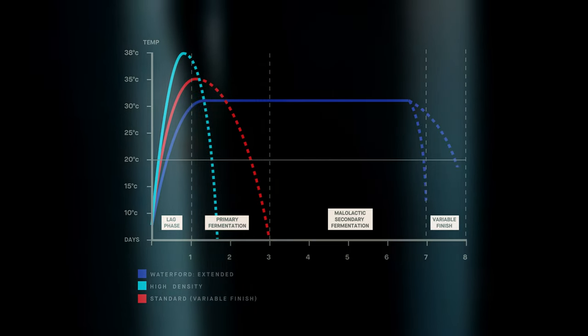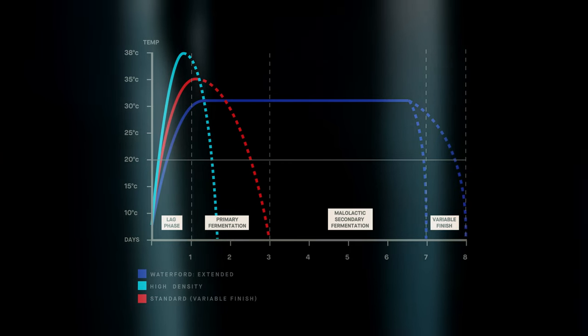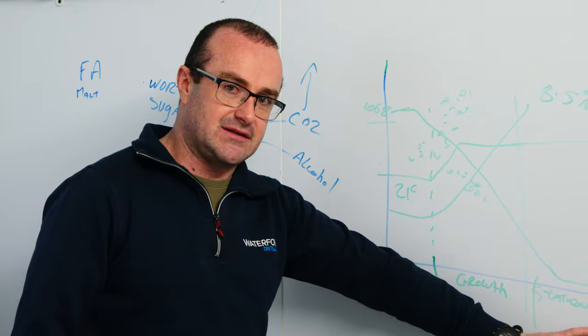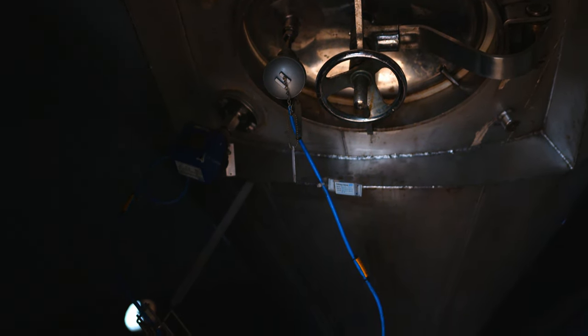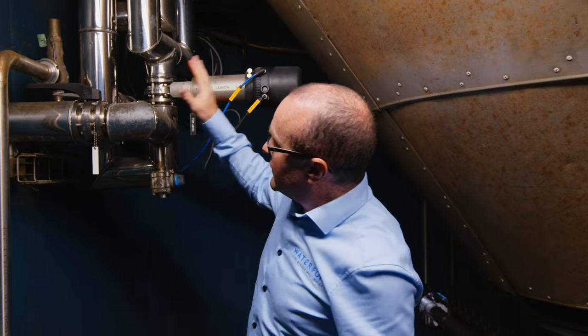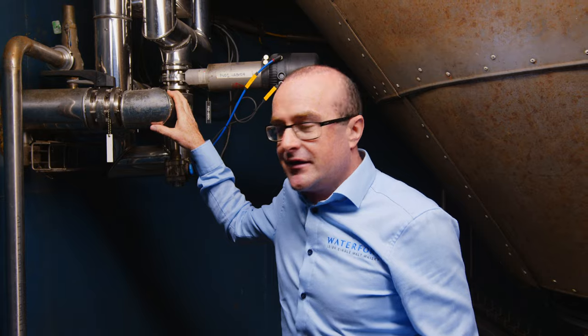The reason those floral and fruity flavours develop is because we do this secondary or lactic fermentation. Secondary fermentation is vital for us. This is the stainless steel conical fermentation vessel, and behind me is our glycol control which allows us to carry out our thermoregulated fermentation.